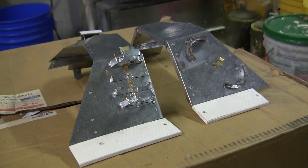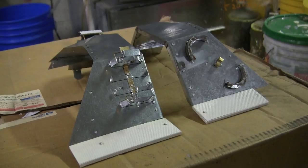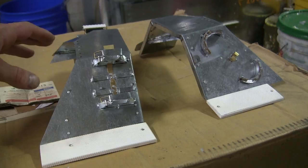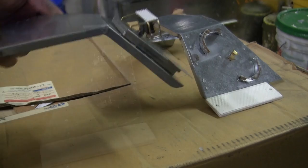Starting with the armored car's rear fender work, the tin work that you see here is completed. Just like with the front fenders on the model, the rear tin work is done in the exact same format with pressed sheet metal that is all bent, soldered, and riveted together. All of the components are held on with the use of fasteners and solder — no adhesives are utilized. Just like with the front fender work, the left and right hand side fenders have certain attributes unique to their respective sides.